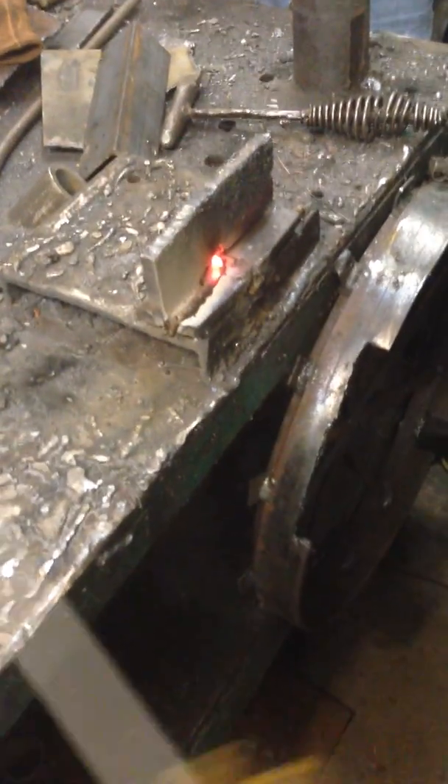If you'll notice, you have a weld pool. Everybody that can see this, you'll see a weld pool right behind the electrode. Where that weld pool goes is where your weld's going to be. So if you see that weld pool's not going equally up on both plates, then you can manipulate it — you can move it. Now, this plate has actually got a little gap in it, so I'm going to be facing a gap that I'm going to have to fill in. You might see a little motion in that weld rod. This is also a demonstration of how far you need to burn your welding rods up — as much as possible without burning the electrode holder. Use them all up — at least to the numbers.